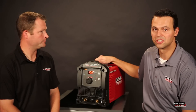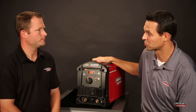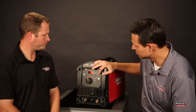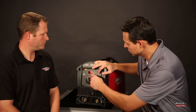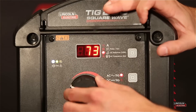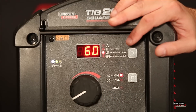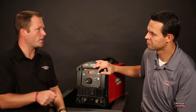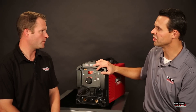It's a little-known fact that when you're TIG welding aluminum, aluminum forms an oxide layer that has a melting temperature three times that of aluminum itself, and sometimes we need an additional means of cleaning through that oxide layer. With the SquareWave TIG you can adjust the balance — turning it down to, say, 60 — and you're actually increasing that cleaning action by having a lower AC balance value, so rather than just a brush you're getting in there and cleaning more. It's an additional form of cleaning action.